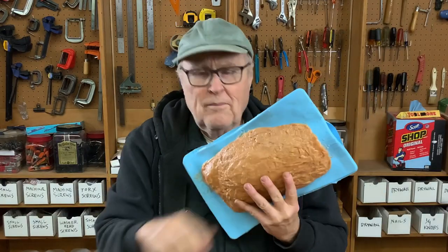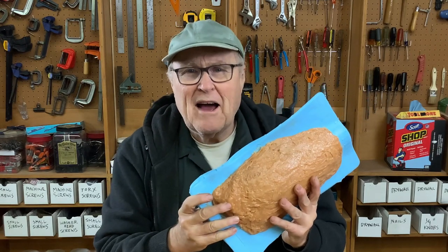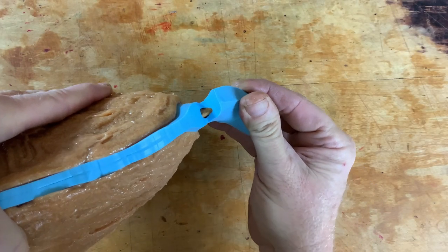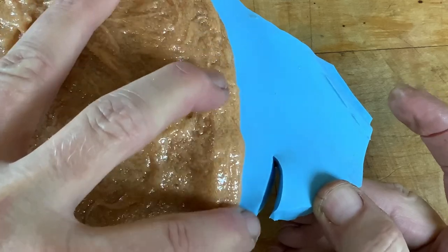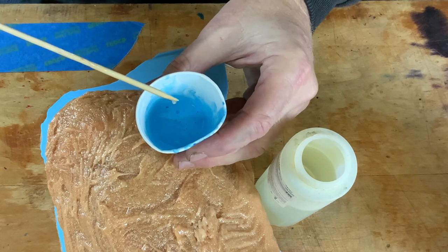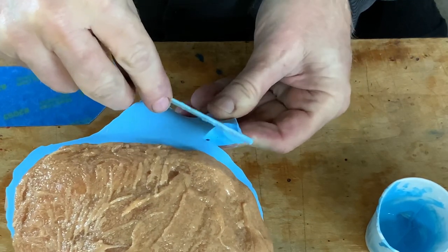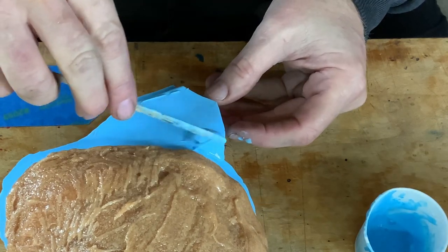The mother shell is all dry, ready to go. Let's pull this thing apart, cut it open, see what we got. The cutting was going good and then I discovered that I had screwed up. Luckily I caught myself just in time, but I just nicked into the fin right there. No big deal because this is a fairly easy screw-up to repair. I mixed up a small batch of rubber and added just a tiny drop of accelerator into it. This accelerator is amazing — it changes a 24-hour cure rubber into about a 1-hour cure rubber, which is great because then I can just get on with finishing the mold and not waste another day waiting.